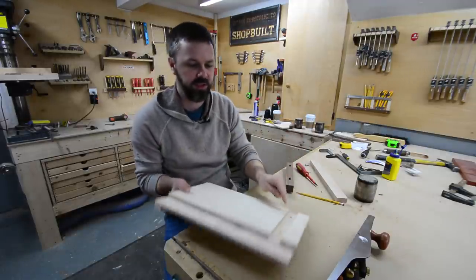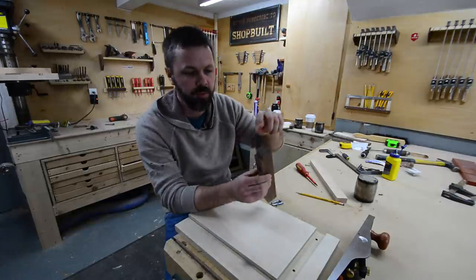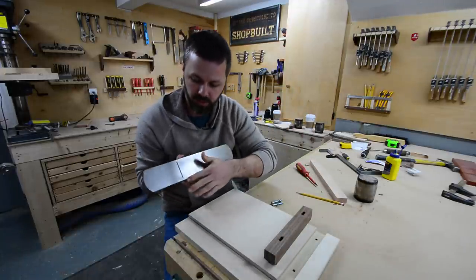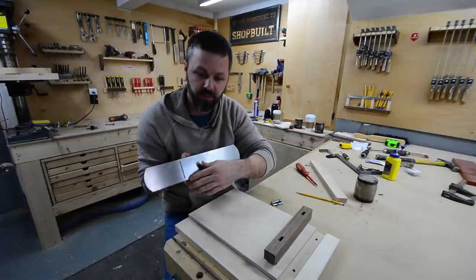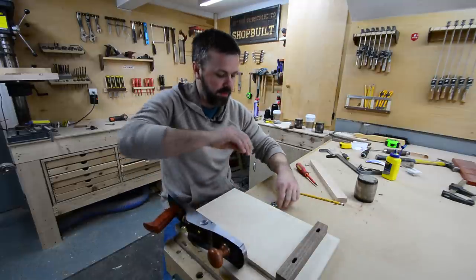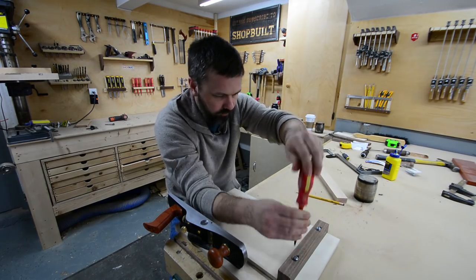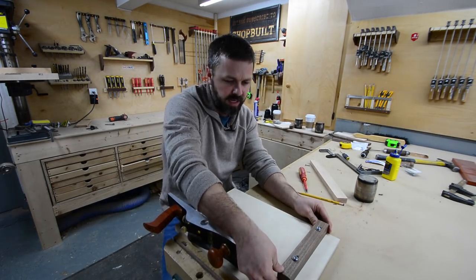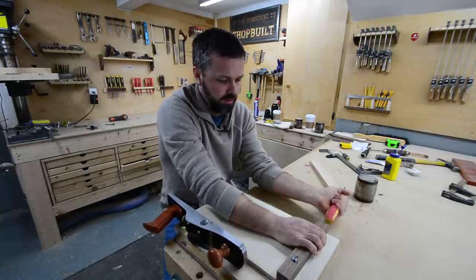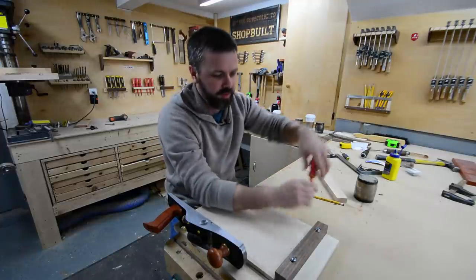I just added a few T-nuts to the platform of the shooting board, and then I also slotted the holes of my fence. The other thing I had to do is put a small rabbet at one end, because you have to allow room for the little space underneath the blade of your plane. So now it's just a matter of fitting it in the slot and bolting it up. To set it up for the first pass, you advance it just past your edge by the tiniest bit, so you can trim it flush with the plane itself.